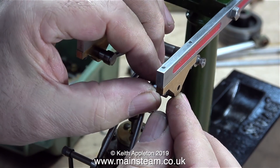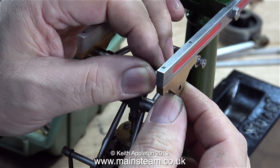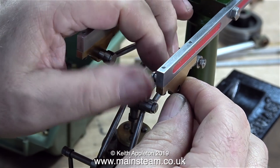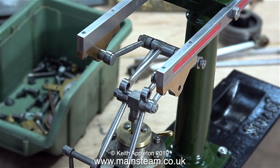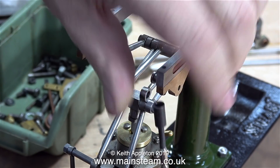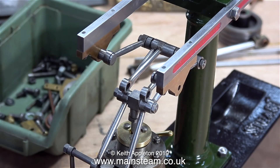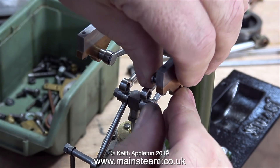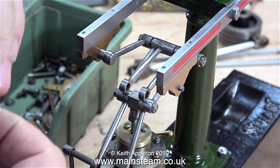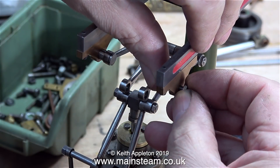Here's the other side — same arrangement. I noticed that the gunmetal bearing bracket is a bit loose; I'll tighten that up later. In fact it's probably a good idea to tighten the bearing now, but unfortunately the bolt heads are smaller than my little socket — it's just spinning round — so we'll do it later with a small spanner. For now I'll continue fitting the outer arm of the Watt's parallel motion to this side as well.